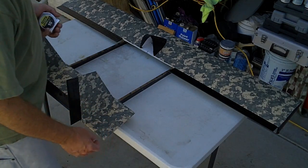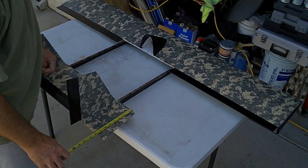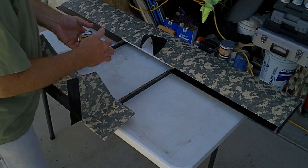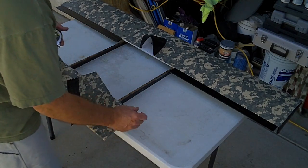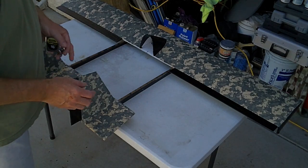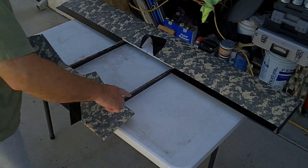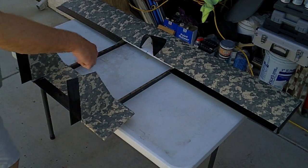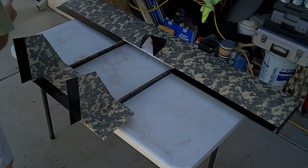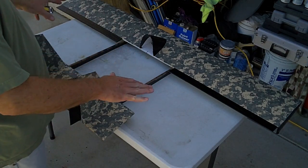And the way that I did that is I just simply took 14 inches, actually about 16 inches of paper sheet by 25. And then here at the leading edge, I removed a 1/2 inch wide for folding. Just like you would fold the fuselage tube, you remove a 1/2 inch for the inside fold. And I completely just doubled it over. I hot glued entirely with spread hot glue, and do a perimeter hot glue here. And then just closed it up and pressed it. Take a piece of wood or something and press it on a nice flat surface till it all cools out nice.